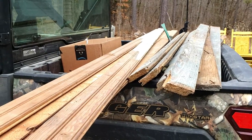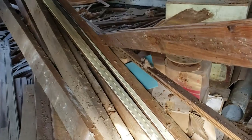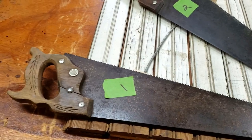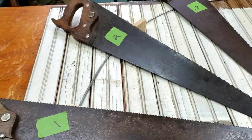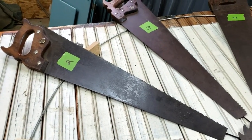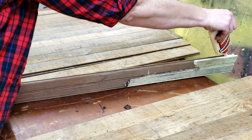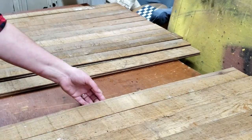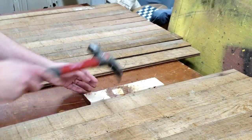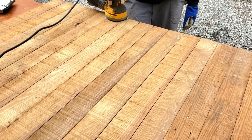For some of you, this may look familiar - this is the old tongue and groove. It's that heart pine tongue-and-groove beadboard that we got out of that salvage house. Initially I put it with the beadboard up, but after I had it laying out I thought there were too many competing lines. So I ended up flipping it over, which is really the rough side - not meant to be the good side - but I used it anyway. Basically just got everything glued into place, made it into a square, then looked at how I was going to mount the back because I needed some kind of support. Got a light sanding, just enough to get the roughness off.